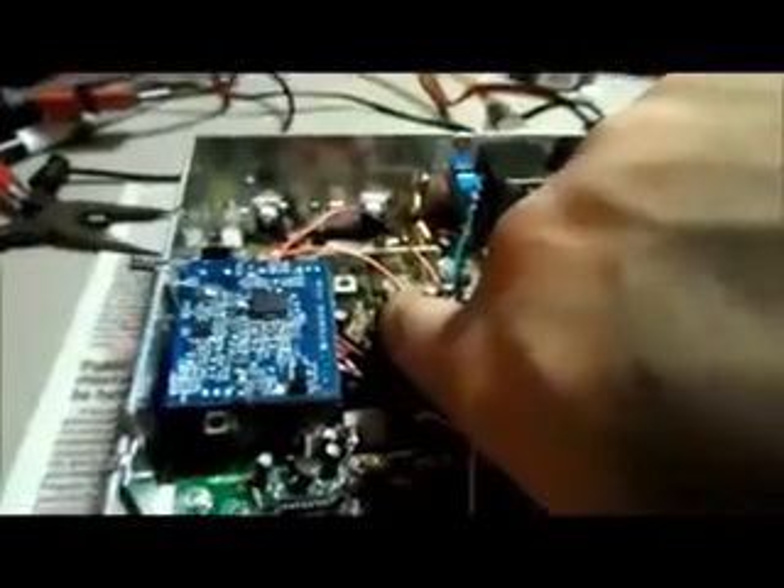Everything's zip tied with the exception of these — they stayed there because they're actually pretty short and good right there. The noise blanker, receiver, and detection were upgraded along with your AMRF amp transistor. It also has a super swing kit installed to give you that low dead key and high output.